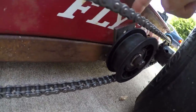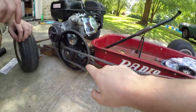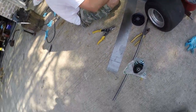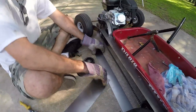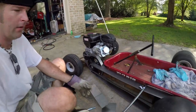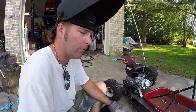I'm going to make two more of these brackets — one for this chain, and one for the front chain. While I was making more brackets for our chain tensioners, Ike went out to the store and to the metal shop. He got some bolts for us and some metal for a chain guard. We can take little pieces like this, and he also got some pipe so we can cut it to length, weld it onto the pieces, and then run bolts through. That way, when we tighten up, we can tighten real tight without crushing anything.